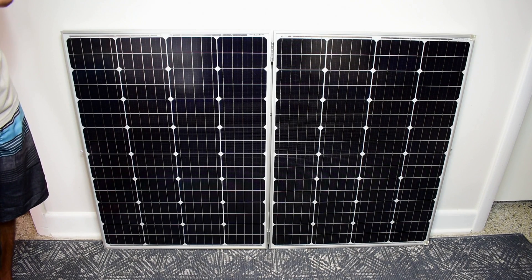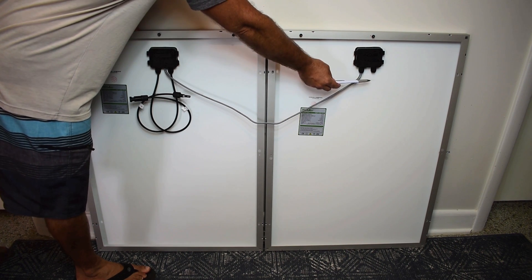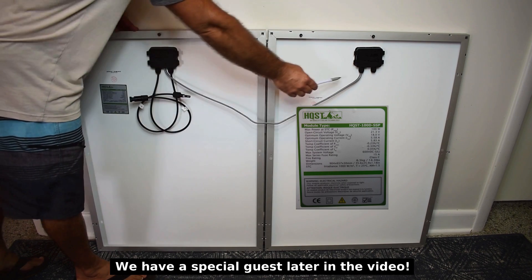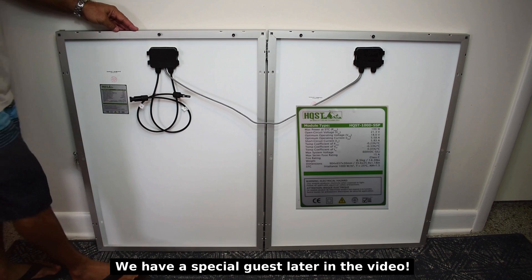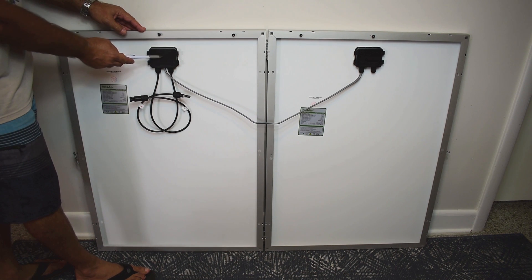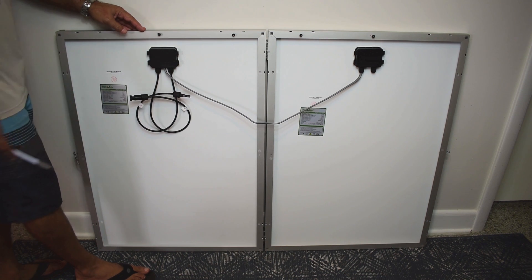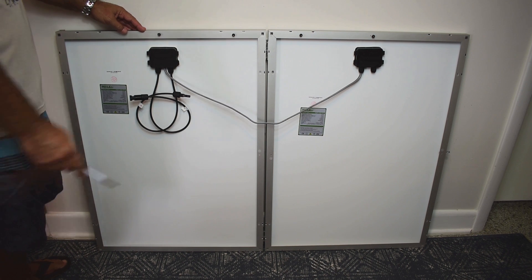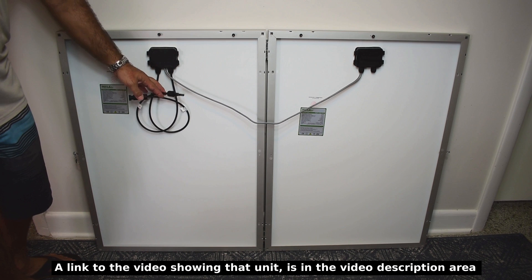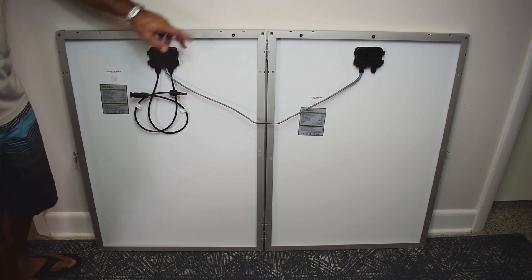On the rear side, the MC4 connectors have been removed from one panel, the hole has been silicone filled, and the panels are connected in series for higher voltage at the same level of current. The cable is 14-gauge marine grade wire. Inside one box are just bypass diodes, and inside the other are bypass diodes as well as a very low forward voltage blocking diode leading to the MC4 connectors. The blocking diode is installed because I want to use this panel to charge lead acid or lithium chemistry batteries in addition to the power station with its built-in MPPT charge controller.